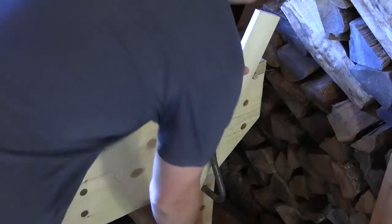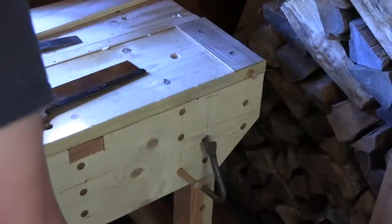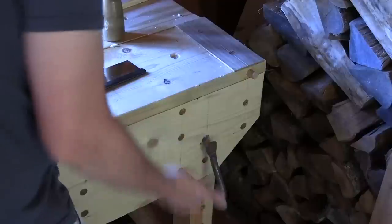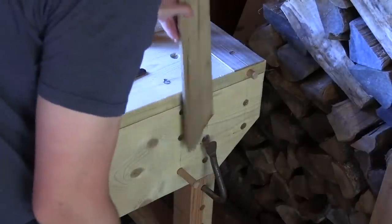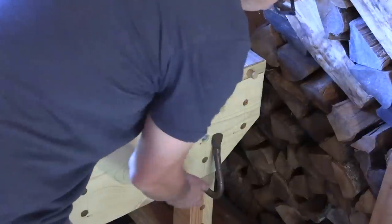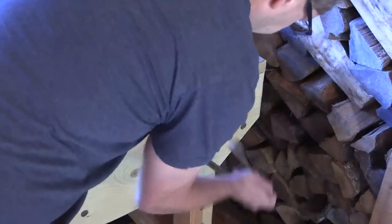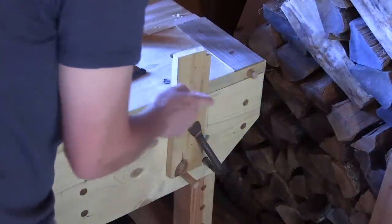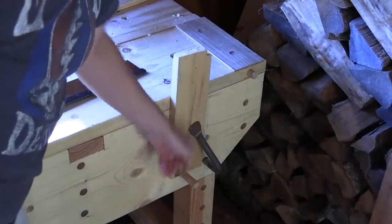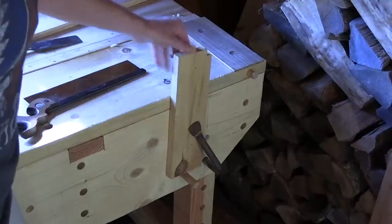Now, if I move on to dovetailing, again, as I said, I'm not suggesting you live entirely without vises, but if you're working on a bench like this and you're thinking, well, how do I do straight-on sawing? The same thing can apply, but a lot of times what I'll do is rest the board on a peg, and then I can use a hold fast to clamp it to the bench, or sometimes I can replace this peg with the hold fast itself and with one device hold it in place.